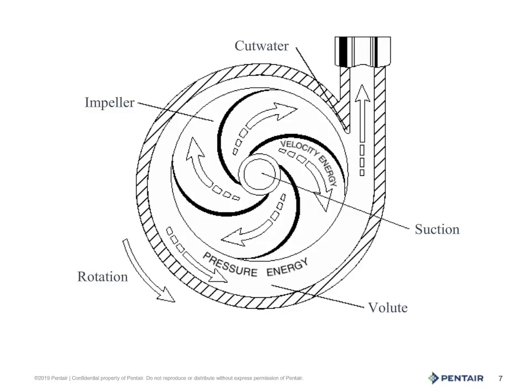So we understand the impeller's radius gives the water velocity, but what creates the pressure? This is achieved by using Bernoulli's principle. To simply put it, water in an enclosed system has an inverse relationship. When the velocity of the water is allowed to go down, pressure must go up. When the velocity goes up, the pressure must go down.